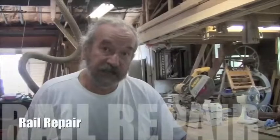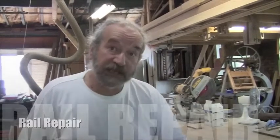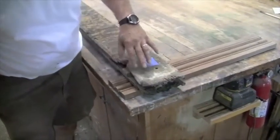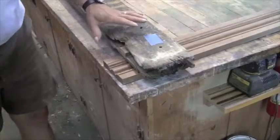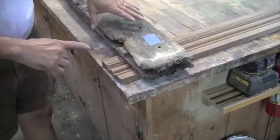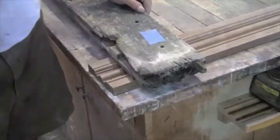It's opened and cleaned so that I can test that mortise, and so that when I glue this thing together, it's going to be the right size and shape, and the tenons will fit into it. Cut good, straight pieces of wood, and then fit new pieces into the trim openings, and then glue and clamp them together and set it aside for another time.